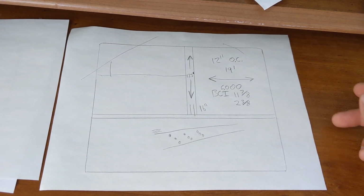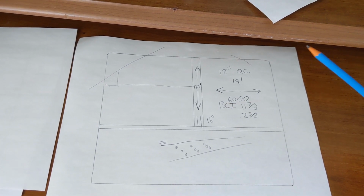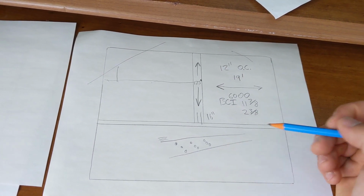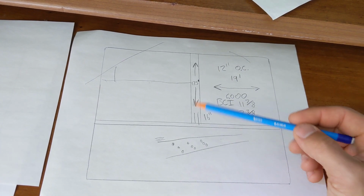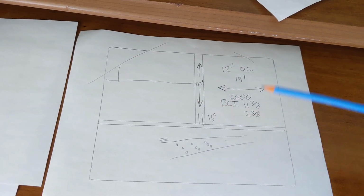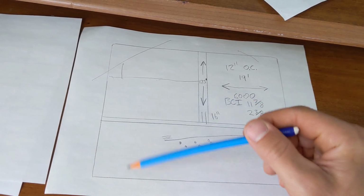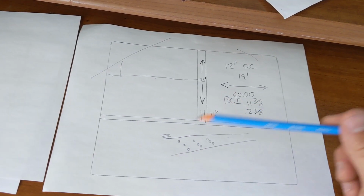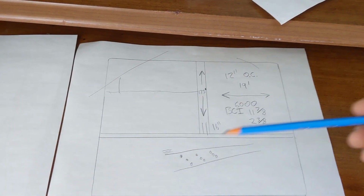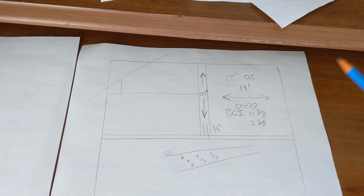I mean, electrical is not a big deal to go through, but it's hard to fit a standard drill in between. There's just not a lot of space. But it's especially important because the I-joists have a limit for where you can drill through them, and you've got to make sure that you've got slope for your drains. And so that is something to think about, is where all of this is. Like, we've got a kitchen right above this area, and then a bathroom with fixtures over here, and so all of that needs to be thought through before you go with any of this engineering, because you don't want to do all of this and then find that your plumbing, electrical, well, mainly your plumbing or your HVAC isn't going to work with your setup.